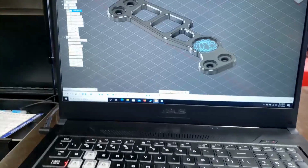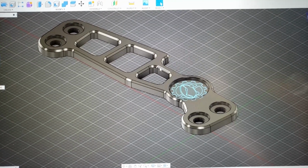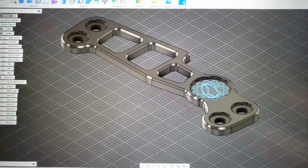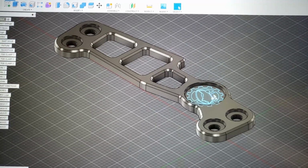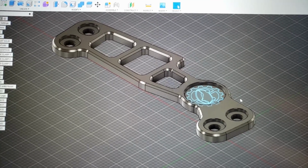Okay, just finished designing this new part. It's also for Honda Ruckus. It's a front triple tree kind of cover, little dress up deal. Doing some profiling, pocket, chamfers, engraving, and yeah, profile. So we'll get to machining that here in a bit.